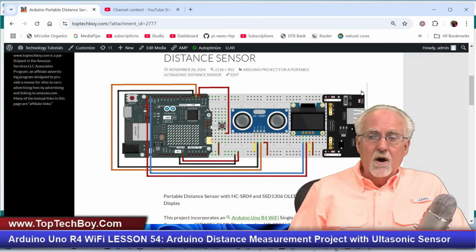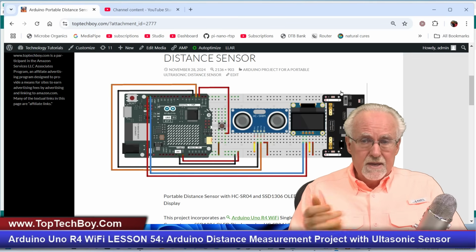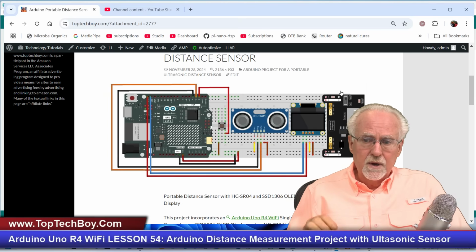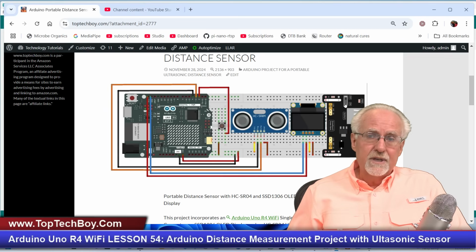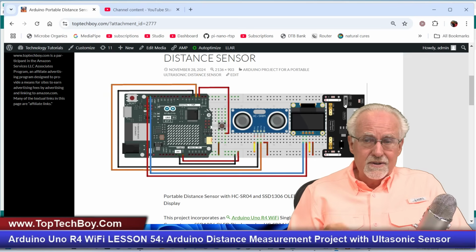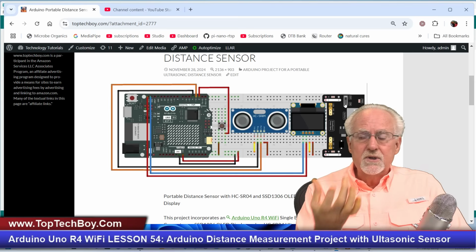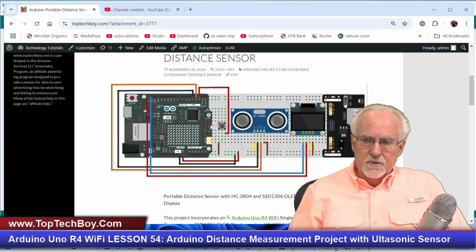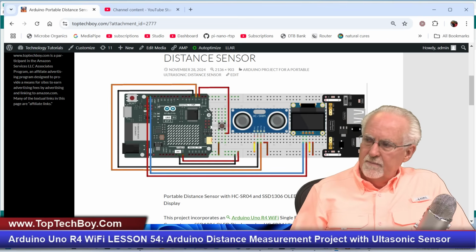back in your kit. Also, make sure that you plug the device back into the foam to cover those pins up so you couldn't have an inadvertent short. And then also make sure when you put it away that you set it to off. So you don't want to just casually walk around with a LiPo battery in your pocket or casually have a LiPo battery sitting in your kit. You always want to be cognizant anytime you use any form of LiPo battery to make sure that you're not going to allow that battery to short out. And so that is what I will tell you every time that we use this thing.